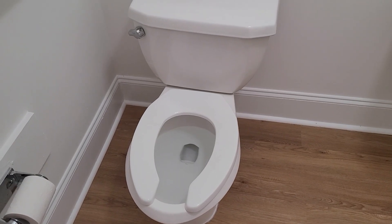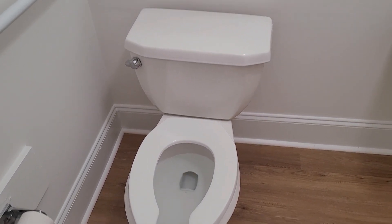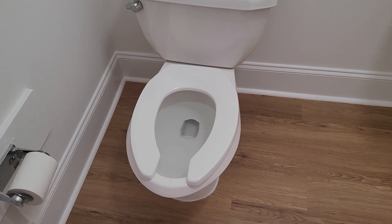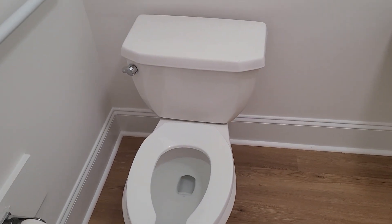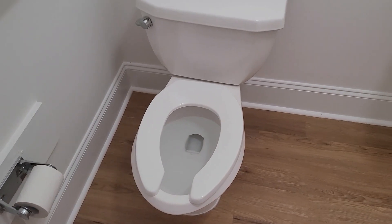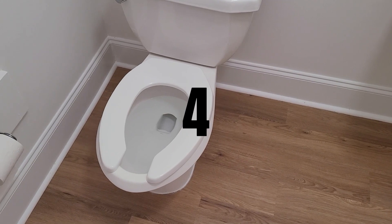Would you be shocked that the quality control isn't great? A lot of pressure assisted toilets have this kind of problem, with quality control not working well. The main problem here is that either the flush doesn't work as well — but usually that depends on the Flushmate; this one has a replaced one, so the flush is short — and the most common problem being the little to no bowl rinse, which is common for a lot of pressure assisted toilets. But the quality control gets a 4.